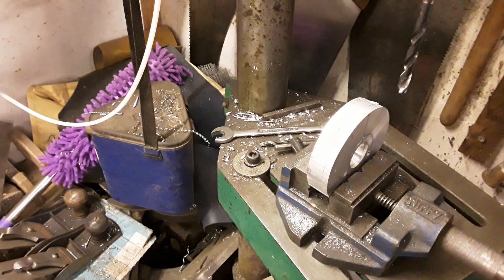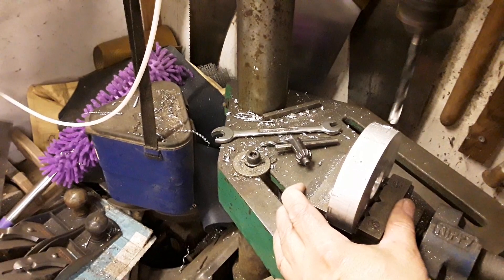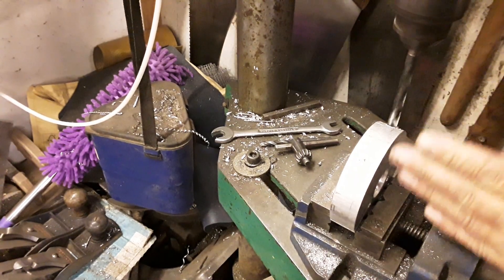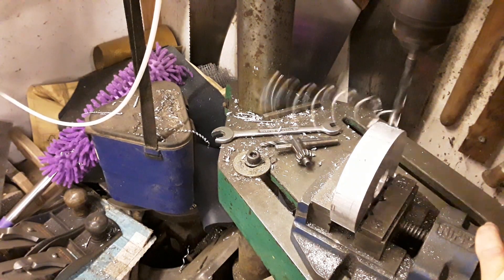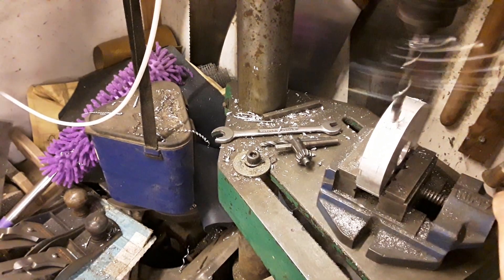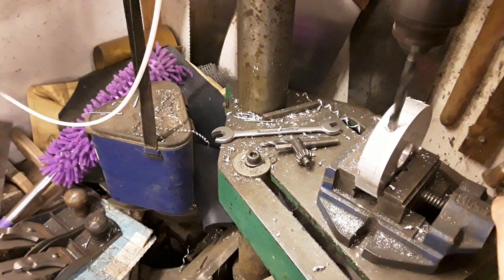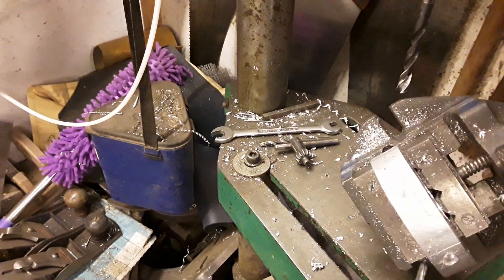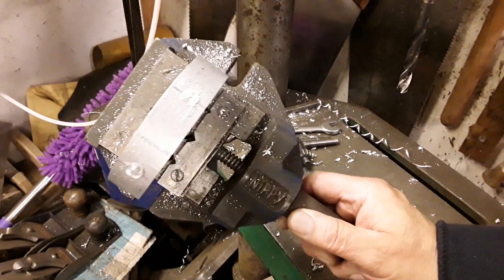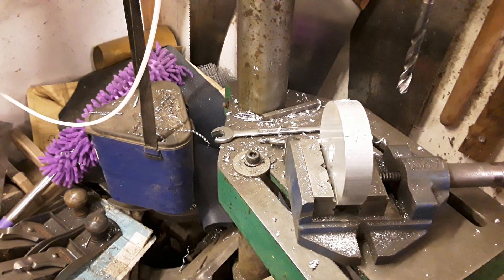The next stage is to drill the two holes on a vertical plane. I've actually drilled them in the lathe previously, set my depth stop, then set it all plumb and now just plunge those two in ready for the pilot hole to be tapped out to 10 millimeter. I know they're perfectly level, perfectly spaced, centered and drilled to the desired depth. So that's the two double handle side done - got a really good angle, all done to the depth and they'll be exactly plumb.